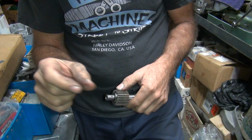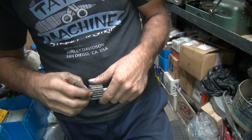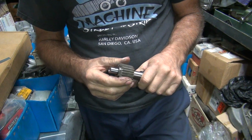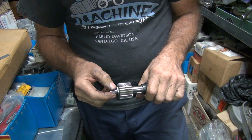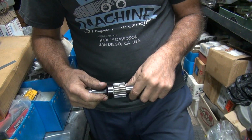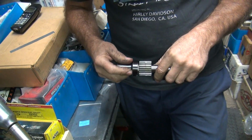We can't because the oil hole's right up on the top surface. So you have too thin of a wall essentially at the top. Right, the oil will come out the top. You have no oil pressure to the crank. That's already a problem already. It's going to get worse. And like I said, I can't get too much shorter here because if you get too high, you've got nothing to tighten with, see? It just rounds off on you.